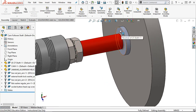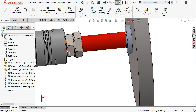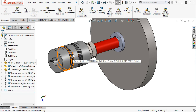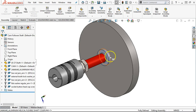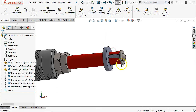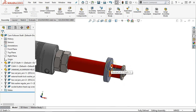And so that contacts the bearing across the rotating face, has enough of the geometry, and the jam nuts are then to preload and then lock in place so that we don't get vibration. The threaded portion is the M16x2 thread, and then again the coupler has some compliance for misalignment even. So we want to keep the shaft in that same runout, but then when we come over to the end, oh, that was what I forgot, the keyway. So the key goes in there, but that's another purchased part. So anyway, the cam goes over the end.